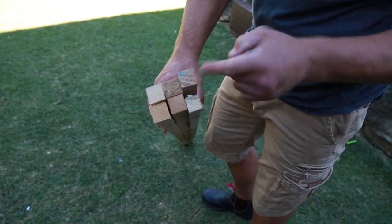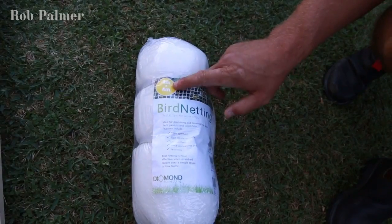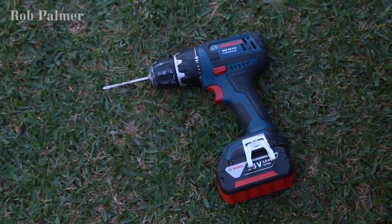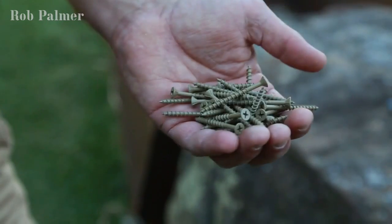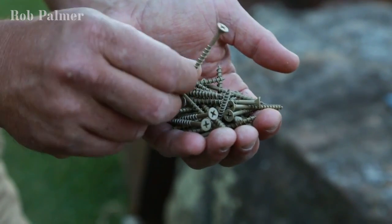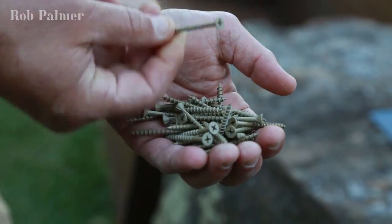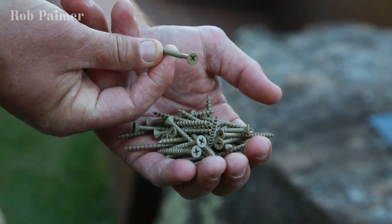25 by 25 bird netting — this is 4 by 4 metres. A pair of scissors, your Bosch 18-volt cordless drill, a roll of duct tape, some rags, and screws. I like to use 50mm treated pine self-countersinking 8-gauge screws with a Phillips head tip. These are the most versatile DIY screw you could probably have in your house.